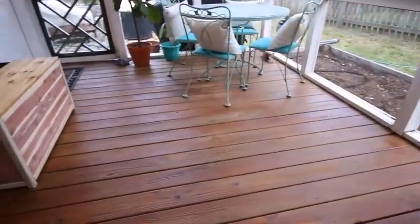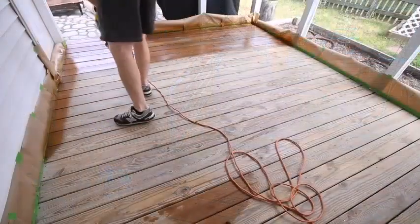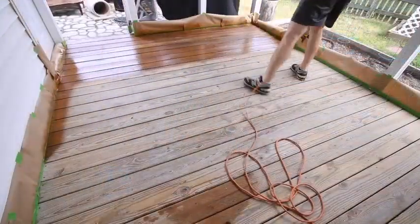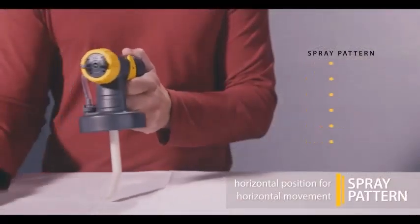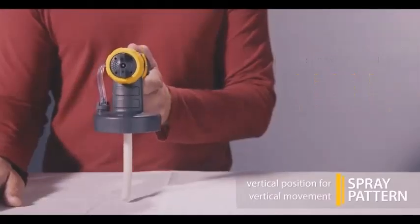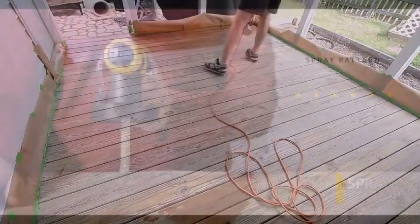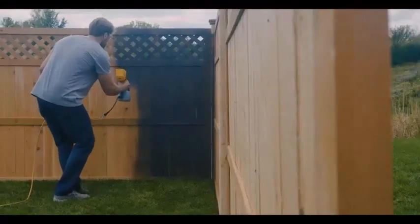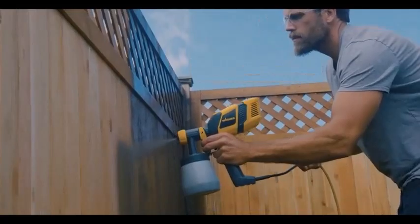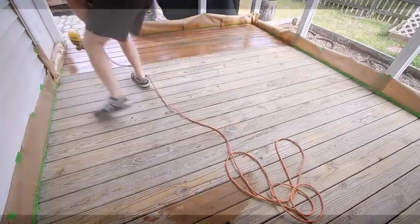If you are a beginner, you can use a paint sprayer, but you must practice using it before painting the item you plan to paint. Get scrap plywood or scrap materials that match the type of material you plan to paint. Get a feel for handling the gun and understand the flow and thickness. See how the spray cuts out, look for overspray, and see if you notice drips. Practice moving the spray from side to side and look at how the paint spray is affected by moving closer and further away from the object. Also wear old clothes that you don't care about getting ruined by paint spray.